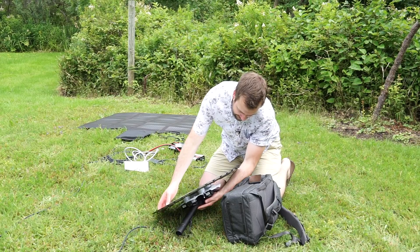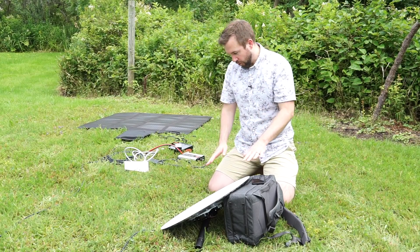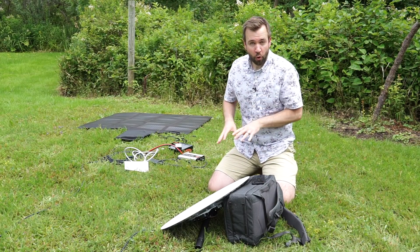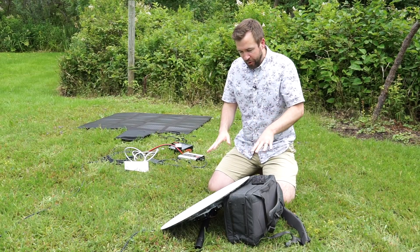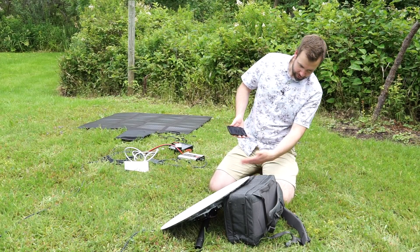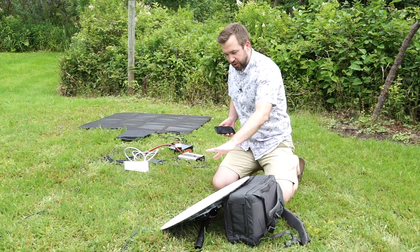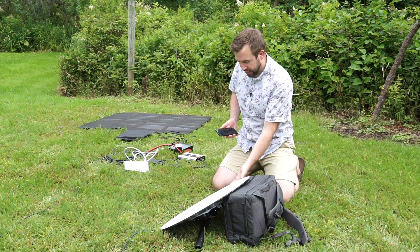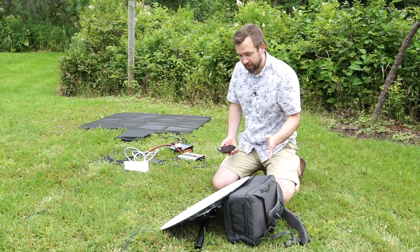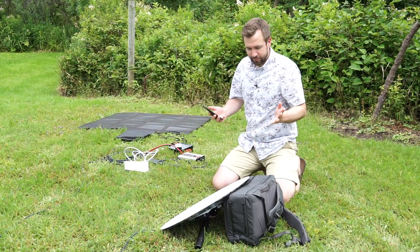Leaving the Ethernet plugged in, of course, I'm going to take it out of the mount and manually position it. I'll rotate it a little bit — hopefully that doesn't matter — and just put it up against this bag roughly with the same orientation. The idea is that the dish is smart enough to realize its actual orientation and steer the beam from that, rather than depending on being exactly where it's supposed to be. The post is doing nothing now, just sitting on the ground. For a camping trip, you could deploy this very flat dish with the motors and post removed to cut down on weight and size, and with just a backpack support, stand it up on the ground like this.